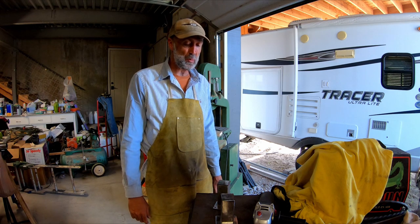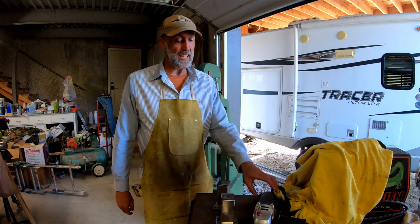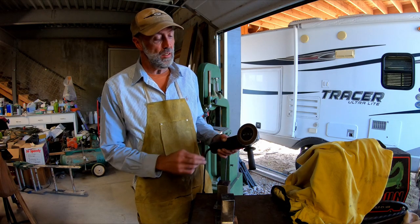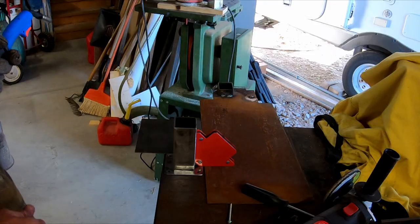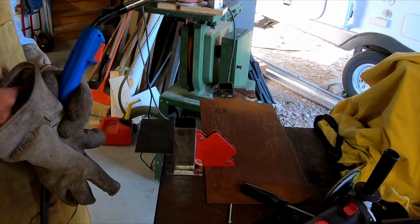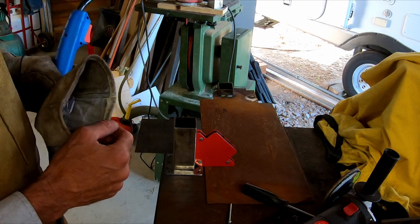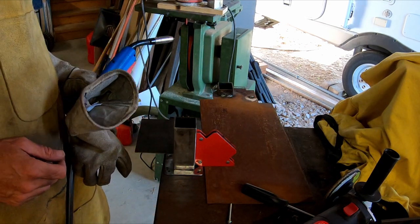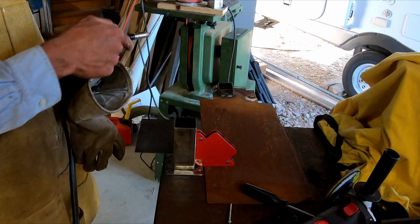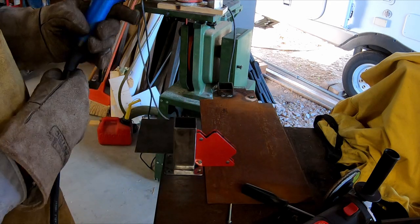Just like with painting and a lot of projects, tons of effort just goes into the prep. There was no way I was going to make you watch me cleaning off the mill scale off all these parts — and I wore down the 60-grit flapper disc pretty far doing that. Before I started welding, I spent some time with a test piece of the same thickness, trying to get the settings right on the welder, so that you don't burn through the thinner material and yet still melt the thicker material. I think I have the settings set pretty good right now.